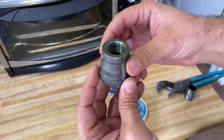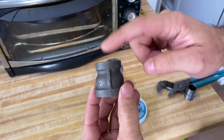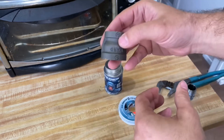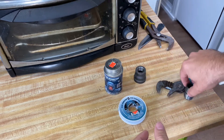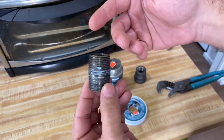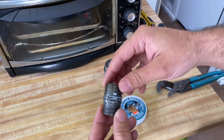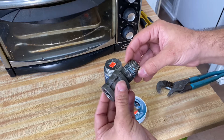I'm going to show you what I'm using to go from a three-quarter inch pipe coming out of my floor down to a half inch pipe. You see this side's three-quarter threaded and this side's one-half threaded. I'm going to be coming out of a pipe for a hot water heater and this is a little stub — just another threaded pipe, a small piece threaded on both sides. You could get a longer one; these come in all different lengths. I'm going to use just this one because all I need to do is go from three-quarter to a half.